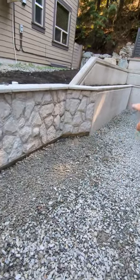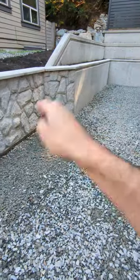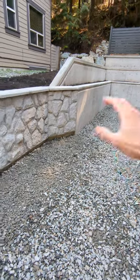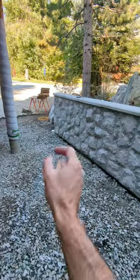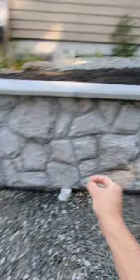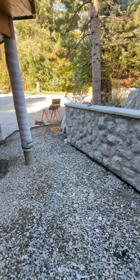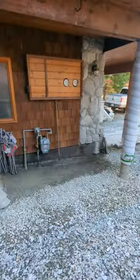We can have a six-inch gap all the way along the wall that we'll put our bead in, then we'll add a little bit of drain rock after, and that will be our drain all the way down. In here the stone is going to get a little lower than our grade, which is fine because we're going to fill that gap with drain rock — we can sort of hide that angle iron error as we transition across. We will need new pavers. We should do a bit of a takeoff of what we have and then decide where to put the new ones.